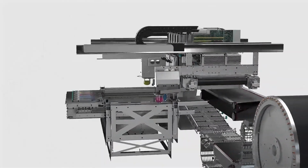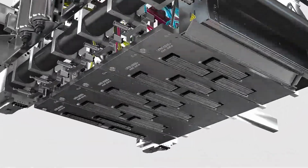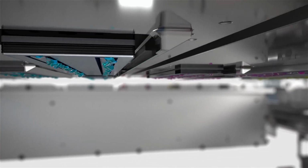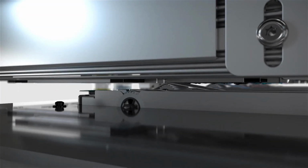During the print process, automated print routines ensure optimal nozzle conditioning, preventing risky manual cleaning that may damage print heads. These routines save a considerable amount of operator time over manual maintenance routines. The procedure involves 2 steps. First, a purge and a dry wipe.